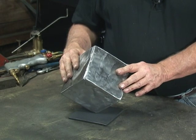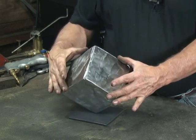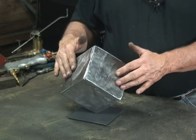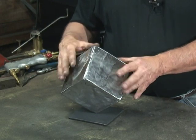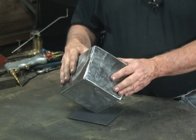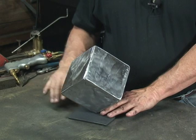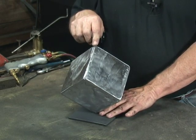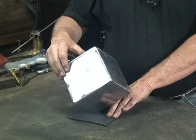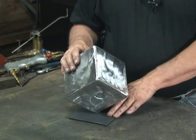This is the five-inch cube that I fusion welded, the one-eighth inch material, hot rolled steel. Sanded down the seams — a couple of them I did have to grind down. Then ground down the gray covering on all six sides to get rid of that hot roll look, then sanded the whole piece. Mounted it on a five-inch square, quarter-inch block of steel with a quarter-inch pin coming up right to this pinnacle, which means that this cube will rotate. Nice looking piece — fair amount of work, but a nice looking piece when you're finished.